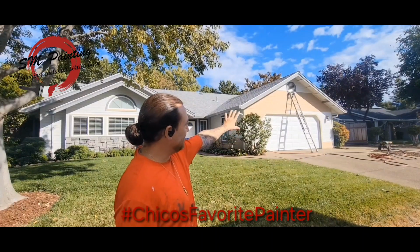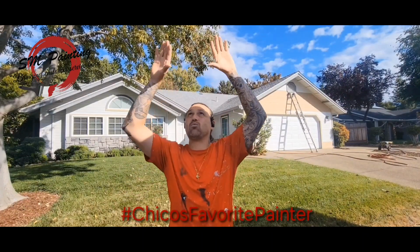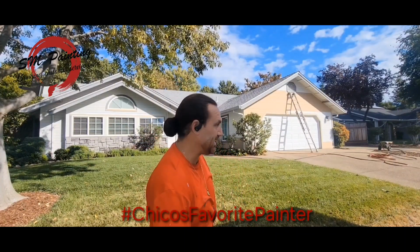And then make sure when you're power washing, as you can see on me on that ladder, I turned around and power washed the back edge of that fascia, because that seems to get really dirty sometimes. And when you go up and paint, you don't wanna have a bunch of dirt in there and it's just gonna fail. You want this paint job to last, okay?